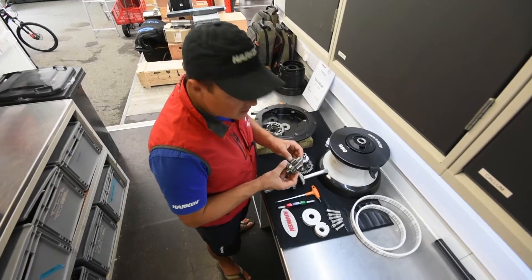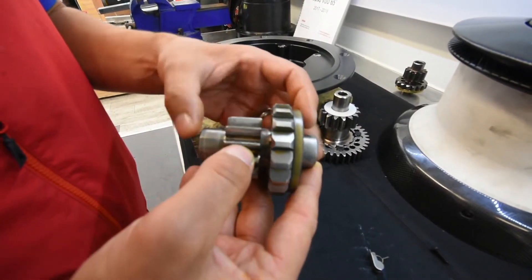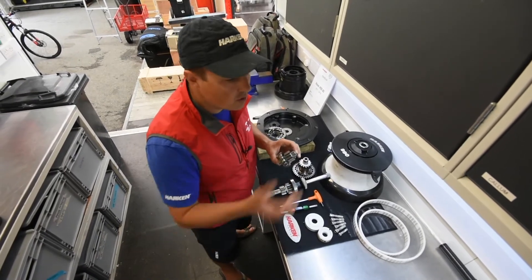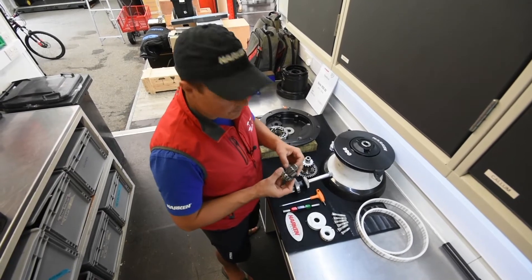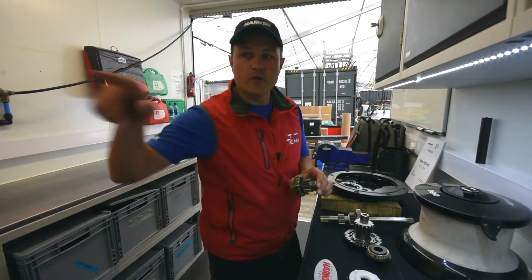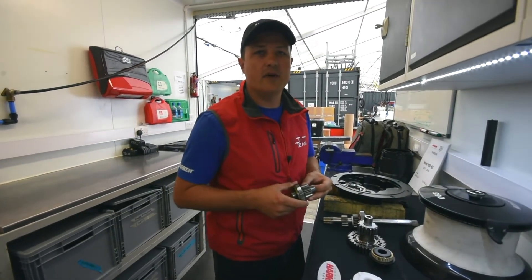As you can see here, this gear's actually got a little bit of galling on there. This can happen over time — all these winches are fully lubricated with Harken grease, but there's so much water running through the boat that that can come off over time. This is just due to the load that the winches see. We've got all the spares in the container here, so let's go and have a look and see where they're kept.